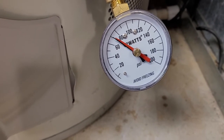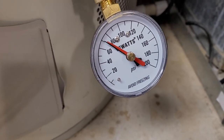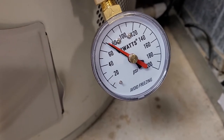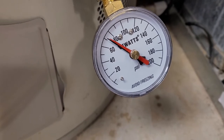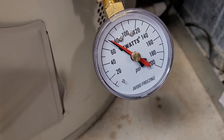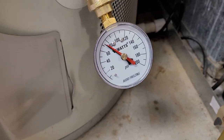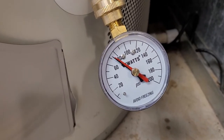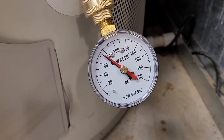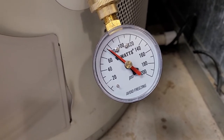So one way to know if your water pressure regulator is working correctly is you buy one of these gauges, put it onto the water heater drain port, and just watch it for a day or two and see what happens. Keep resetting that little red indicator dial and it'll tell you what the peak pressure has been reaching in the house. You try not to go over 75 — the range, I think per building code, is between 50 and 80 PSI. So 80 would probably be the max, and 75 gives you good solid water pressure but below the max.